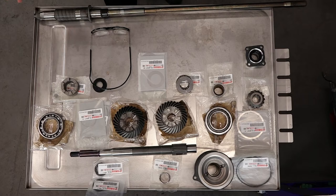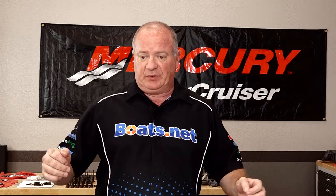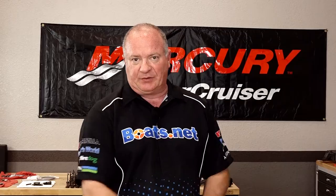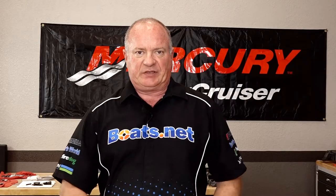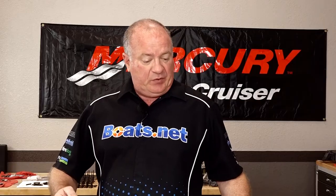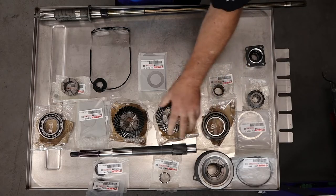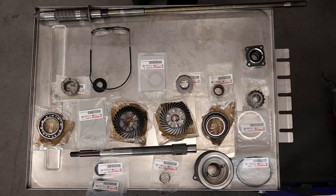As you can tell from this table, my parts list is really extensive. What I'm about to do wouldn't make sense for you to do if you had as much damage as this unit — you would just call us and replace it, get a whole new Yamaha unit, and bolt it back to your power head. What I'm going to show you is the shimming process required if you were just replacing your lower unit housing and putting in all your original equipment. That happens often — you break off a skeg, you don't want to trust a weld, so you replace just the housing. Conversely, if you were replacing just one bearing or gear, you'd still need to go through the shimming process, and that's what I'll walk you through.